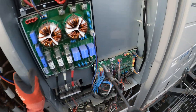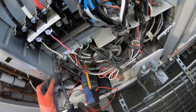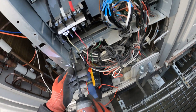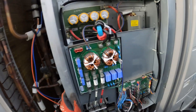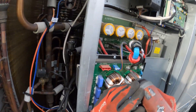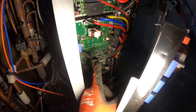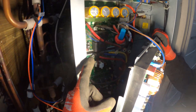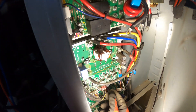The inverter board is behind this plate. We've got four screws on each corner — let's be careful not to lose those. We need to take those off so we can get to the back. I'll pull these three wires out and take those connections off. Here's that board, and behind it is your inverter board. This is your converter board. We definitely want to do a check on both, but I'm going to start with the inverter. I'm going to do resistance first.